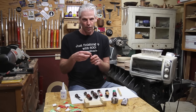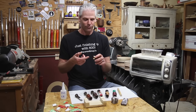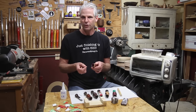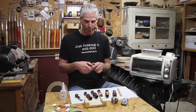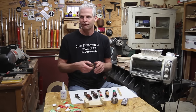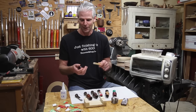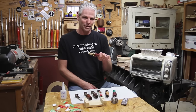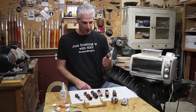When you glue on the rings, always wipe it clean and remove any oil. I just take a piece of 100-grit sandpaper and run it around in there. Somebody mentioned using the tip of a parting tool to really scrape it up, and that would probably work better. I've been doing these for seven or eight years — some of them are still bonding fine, and some have failed, and I always do the same thing. Getting them out in the weather causes expanding and contracting that can pop them loose, but they're a lot of fun.